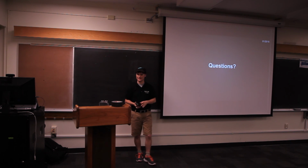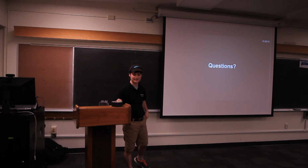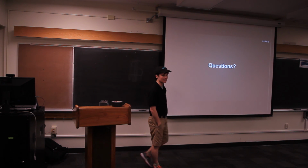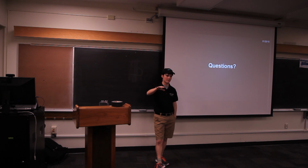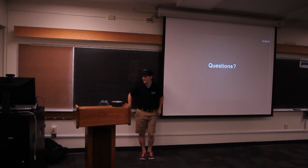Use it for what it's needed for. In BTS, sometimes I'll use it for behind-the-scenes stuff, like funny things that happen off camera. Usually the Rode mic is so directional it won't pick up what people behind the camera are saying, but the camera mics will, because of their pattern, they pick up whatever's right behind the camera really well. So in BTS, if you hear the cameraman talking, it's probably camera audio that I'm using.